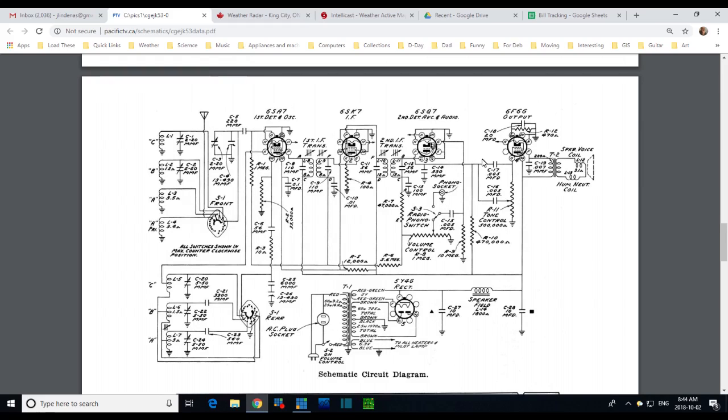Okay, so getting back, signal coming around to here. Now, on this side of the capacitors, the plate voltage, a couple hundred volts. We certainly don't want any of that on this side. This capacitor is in the same boat. If this guy leaks DC, it's going to work its way up onto the grid of this tube. That's a serious problem with a radio. If these blocking capacitors leak and shift the potential of the grid positive, then the tube will conduct more and more current, will run hotter and hotter, and wear out sooner and sooner. And you won't even know it necessarily. You can play this radio with a hot output tube and not really know it. These tubes are hot anyway. You can't really tell even by touching them.